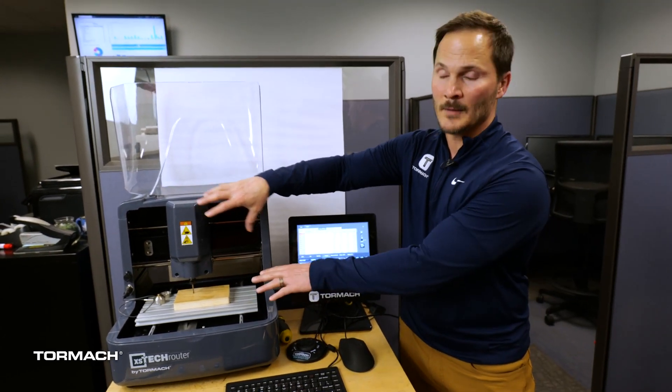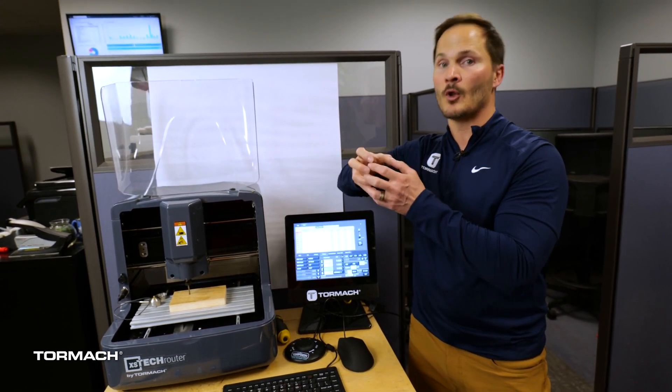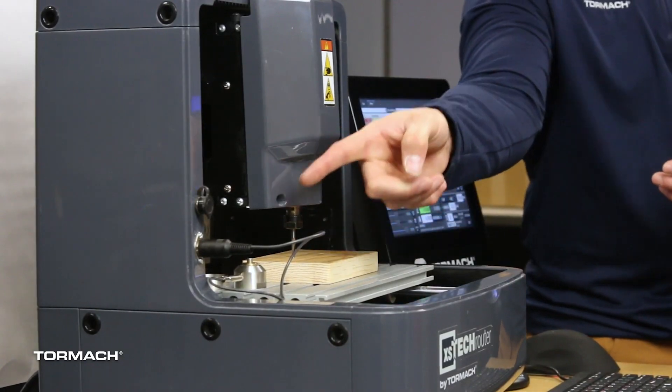In review, we've now established our electronic toolsetter. What's really nice about it is every time I switch out a tool — maybe using a big tool to hog out material and then something smaller to refine it — I don't have to re-establish my Z every time. I can touch off the tool and it does the math from the top of the stock I've already established. Our next video will establish our origin and set up our zero-zero-zeros for milling material. Thank you for watching and be sure to subscribe to watch the rest of our series.